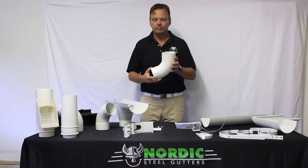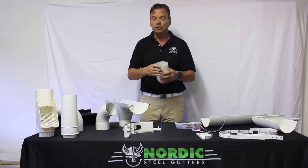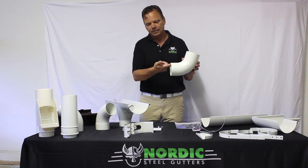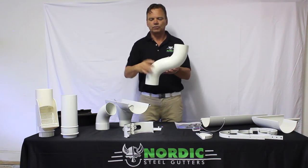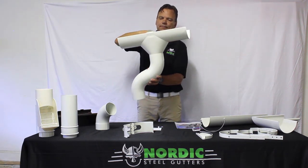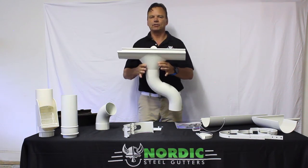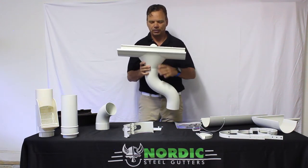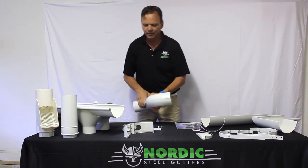Your elbows — conical, 70-degree, double-seamed. You have the larger side; the seam is on the outside, and we actually turn the seam to the inside to get the smaller part. You connect them — they always overlap 2 inches. Same when you connect them to your outlet. Despite the fact that the material is so slick, the fit is very good. You do not put any screws, you do not put any rivets through this at all, which allows for a very smooth-flowing system without any problems.